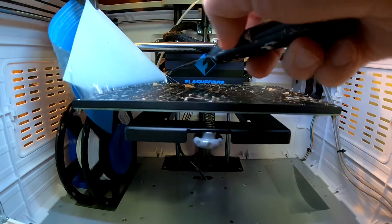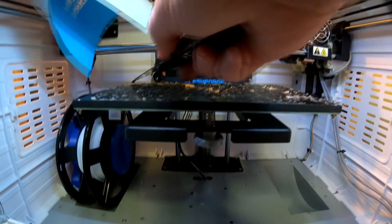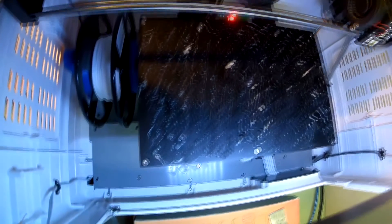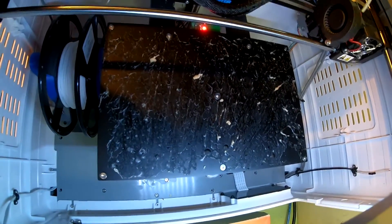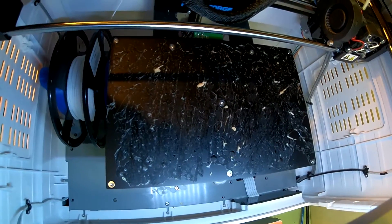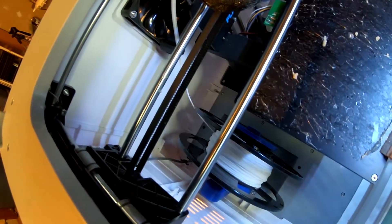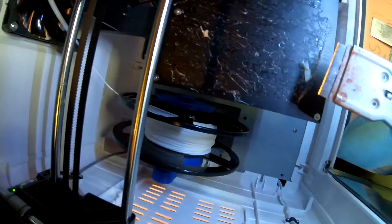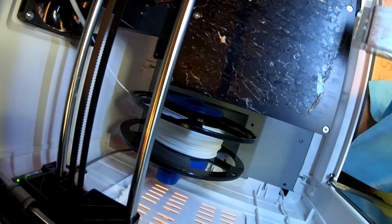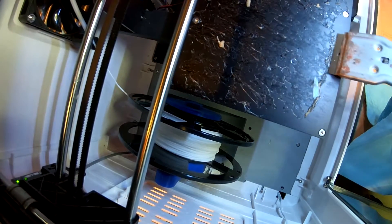Almost got it — all right, that's it. Let's take a look at our print bed. It's got a lot of residual glue on it. I'll have to try to scrape that off and also use some alcohol after it cools off. What seems to work the best, as you might expect, is still heated. I'm using this paint scraper, just carefully pushing the glue. The bed itself is made of aluminum, so the paint scraper shouldn't really hurt it.